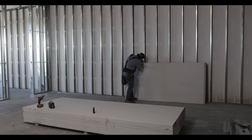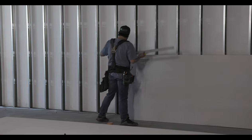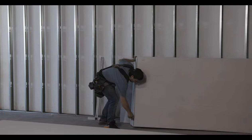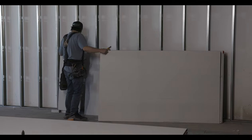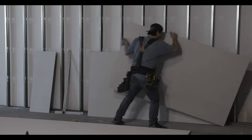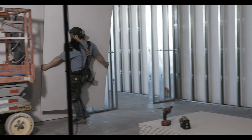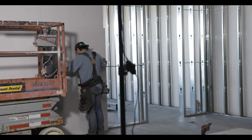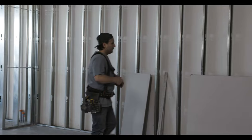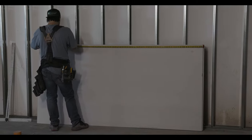For five-eighths, I always score twice. These are angle cuts, so I'm measuring side to side on those tops. The angle cuts aren't because the sheets aren't level — it's because the roof is sloped. Make sure you leave three-quarters of an inch for deflection down below the deck with your sheets, and still draw your centers on them. Get all your tops cut — I make a list and cut everything. I'm in a small spot here so I'm just reading the numbers I wrote down from the wall, side to side.